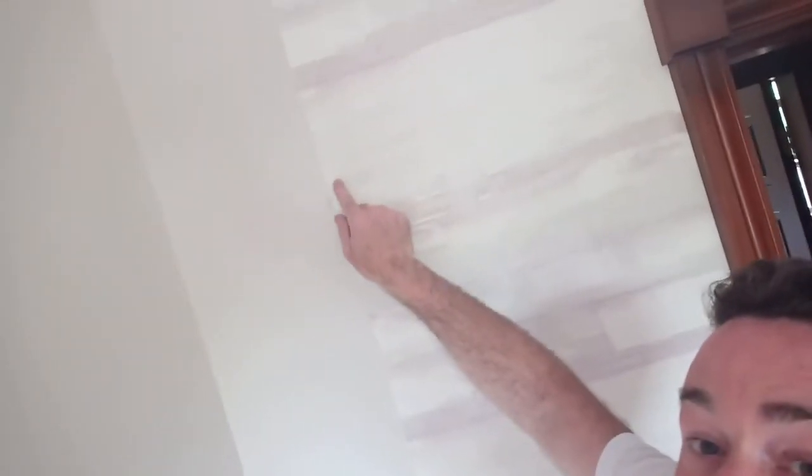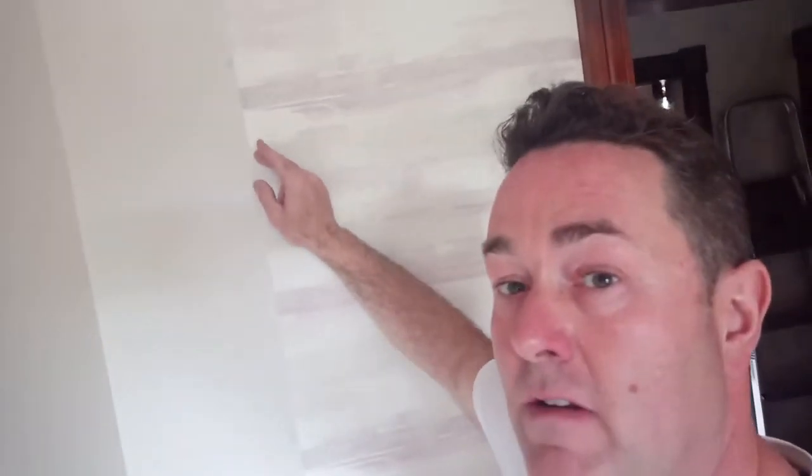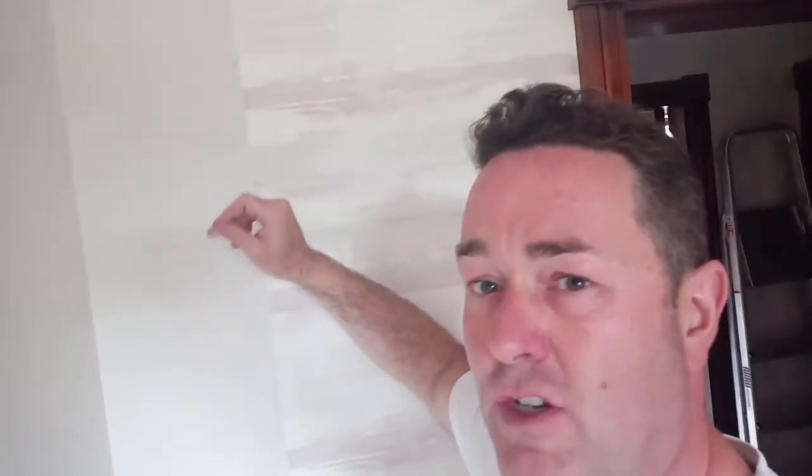I've just measured that angle. Let me quickly show you what I've done. I've measured from that edge to the collar. I've done it three, four times - top, middle, bottom - to make sure I'm alright. It comes in just a fraction over 10 inches, top to bottom. It's not running out, which is brilliant. Just over 10 inches - 250 millimetres.